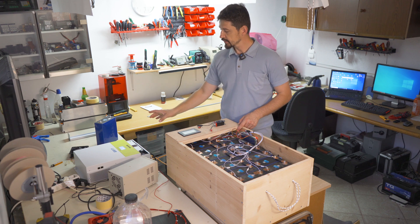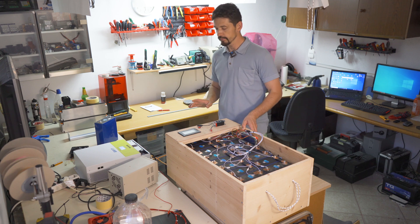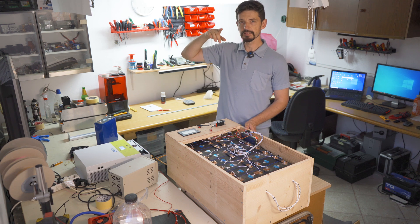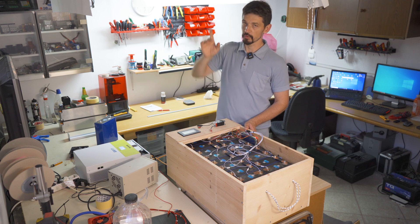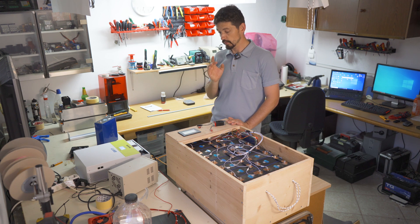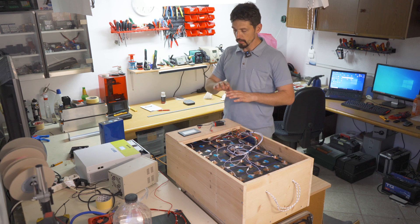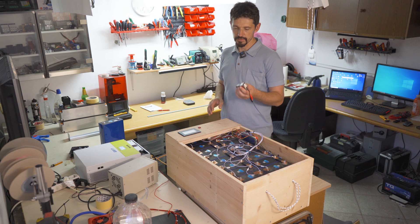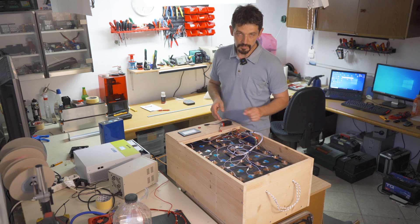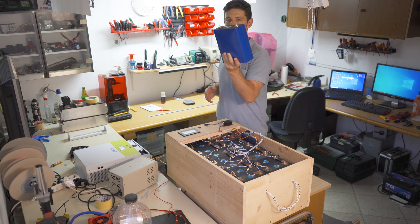In the meantime, I connected it to the hybrid solar inverter and started charging. I monitored the voltage and everything was okay until evening when I went to watch a movie. I came back one hour later and one cell had exceeded 3.65 volts — up to 4.4 volts — which is not acceptable and very dangerous. I immediately disconnected everything and used resistors to discharge the voltage. These are 3-amp resistors. The next day I came back and saw the battery was inflating — it had swollen up.